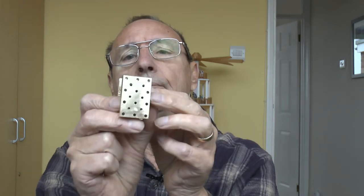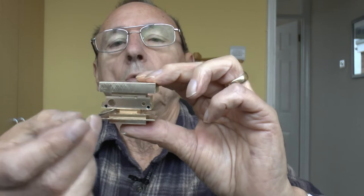The other thing I've done is that those holes, rather than just being drilled as they were in the aluminium version, I've also reamed them. Thanks to Bill for the reamers — Bill Todd, one of the guys who watches this channel, sent me some reamers, which saved me about 30 quid. You're not going to be able to see it on camera, but there's a really nice smooth finish on those holes now, which should help the filament slide better. That's the hole for the heater.